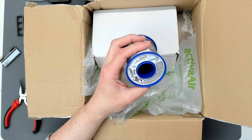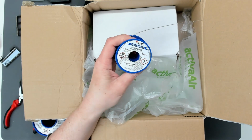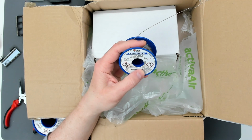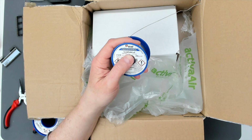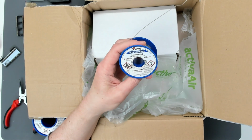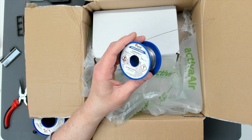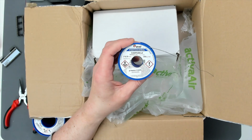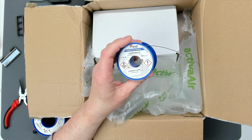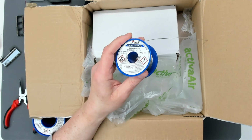Several, in fact. But no, I had asked him about solder previously, because I always buy this stuff here. Don't ask me why I ended up starting to buy this stuff, but I do like it. And this particular one I used to buy imported from Poland, and it's 60/40 essentially, but it's got 2% copper, and I really like that, but it's 0.7 mil as well, but I think the copper is primarily for tip longevity, so they won't export this from Poland now. Probably something to do with Brexit, which gets blamed for everything, of course. But the place I used to import this from, they won't export it to the UK anymore.